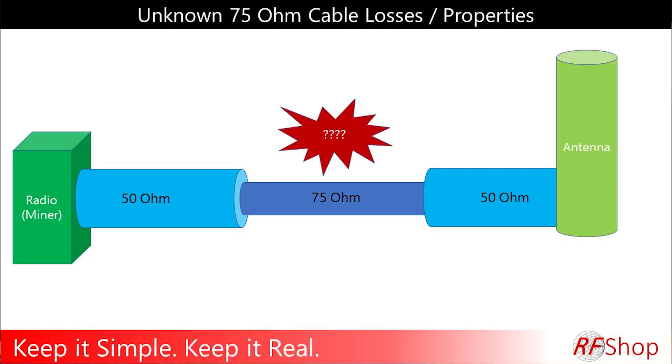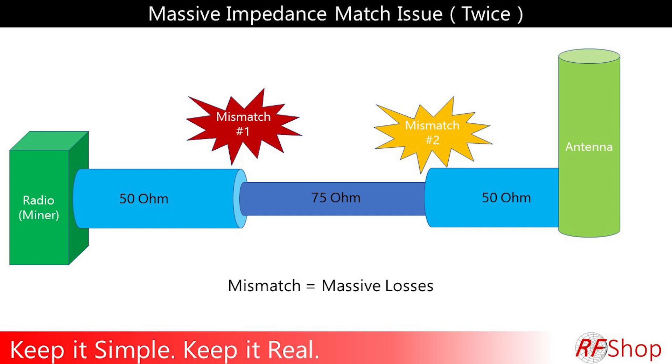Although you may say you'll save money by using existing cable, the connector conversions and all the mucking around is going to cause trouble. The other issue is cable losses — everybody, myself included, is very focused on getting the lowest possible cable loss from A to B. The typical cables installed in your building for TV are probably not the lowest-loss cables available. So cable losses would also be worse. Even setting all that aside, the complexity is secondary — the primary problem is the massive impedance mismatch. You don't want to do it.